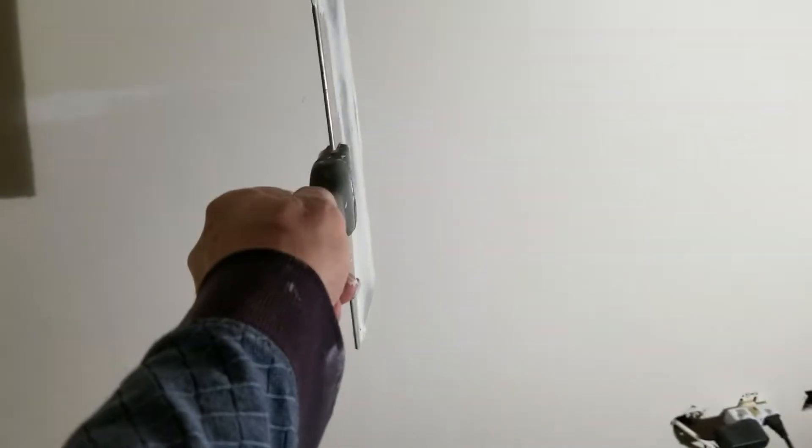I just used my nine inch knife here and you can see I've done about nine inches above the tape line and about nine inches to the right of where the border is. Now you can see just a little bit of that bump left — we're starting to fill it in nicely. We'll let this dry solid and then we will sand it down, getting it as flat and without any ridges as possible. Then we'll go ahead and put another coat from the wall all the way straight across, feathering it back over almost to the outlets. So by the time we're done, this is going to be about a four foot by four foot feathered out patch.